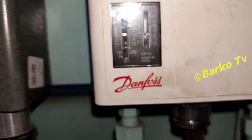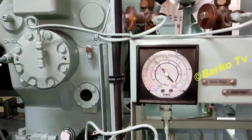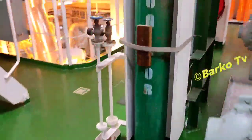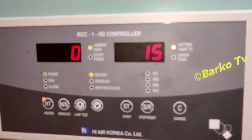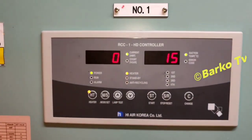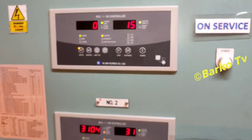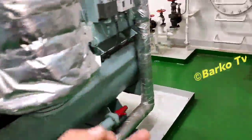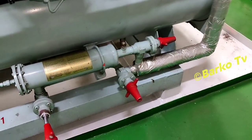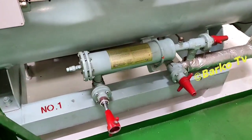We need to observe if the pressure is rising. If the low pressure gauge is not stable, it means there is valve passing. Right now the aircon is shutting down — anti-recycling is activated, which means you cannot immediately restart your compressor.